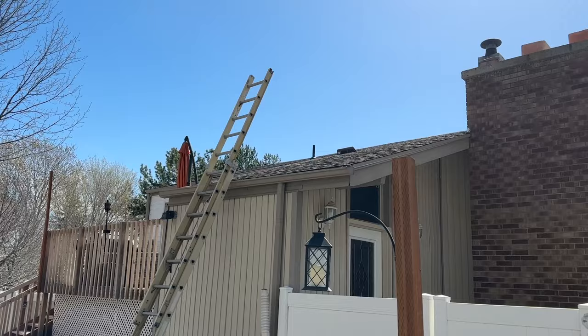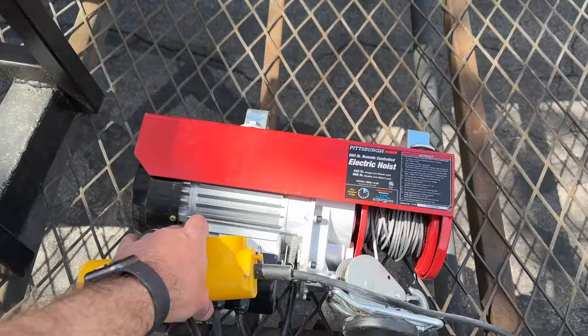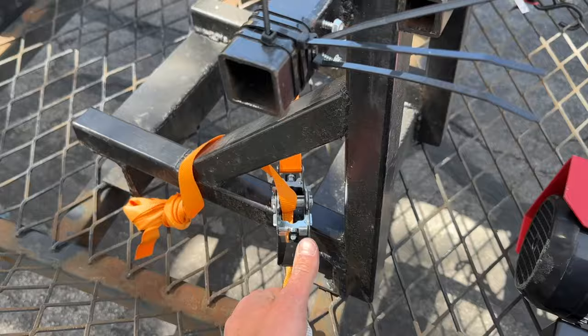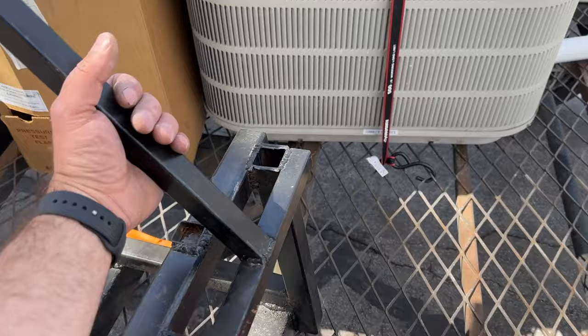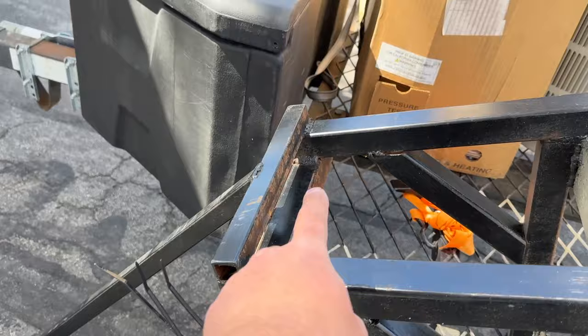From the ground level, you can see our ladder set up. We're going to take our unit, set it right here, get our hoist set up, and drop it about 12 feet onto the ground. This is the means by which we're going to be lifting — or dropping — this off of the roof. This is something that I made myself. These can be bought for about $800, but it's a pretty simple set of bracketry. The two brackets set up into the rungs of the ladder, and the hoist attaches to this metal bar here. We'll show you that in action in just a minute.